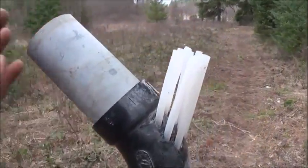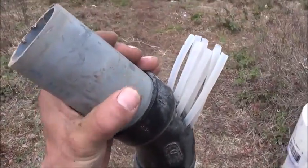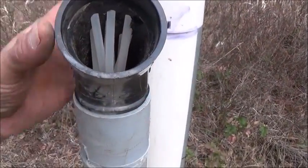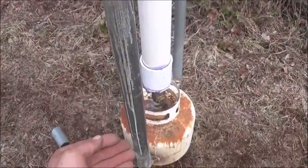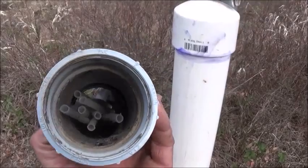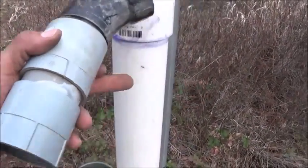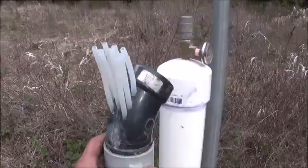As water comes in from uphill, you can see all our input straws — I've got nine straws here that are just hollow clear tubes running quite a ways down the pipe. When the water flow comes by, it creates a nice vacuum draw against those tubes, which sucks air into the tops and disperses it as bubbles all the way down the pipe until it gets trapped in the Tromp tank system. You could space them more evenly, make a plate to hold them so water flows more evenly around them, or stagger the ends to create a swirl or whirlpool effect in the water that might make it more efficient.